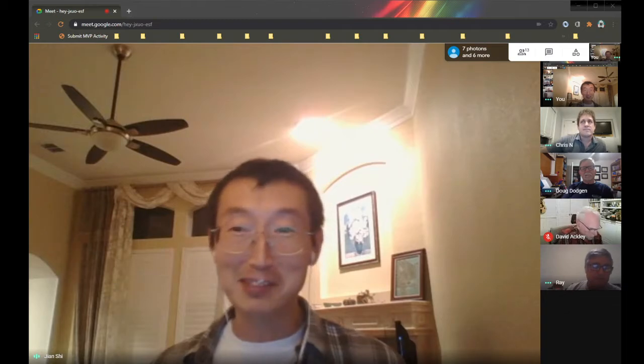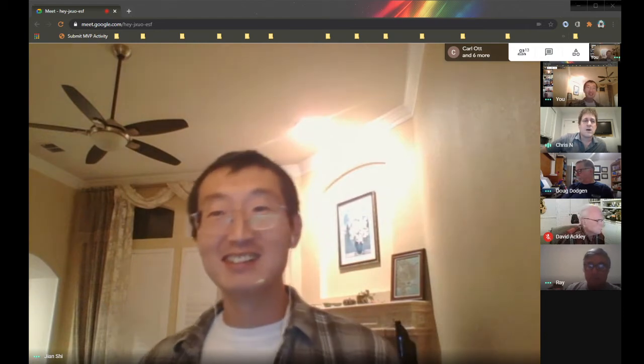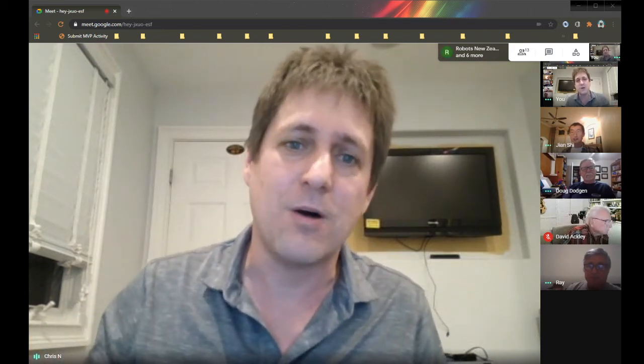Well, yeah, that's what I'm using now, and it's working. It looks like I'm getting data, and the speed is good. Yeah, but at a megabit, you have to think about it this way, right? A megabit is about 10 bits per byte, with the start bit and the stop bit. So you're talking 100,000 bytes per second potentially coming in. Not continuously, obviously, but let's say even a couple of them in a row, which means you're getting an interrupt every 10 microseconds. Are you really pushing it with an interrupt every 10 microseconds?